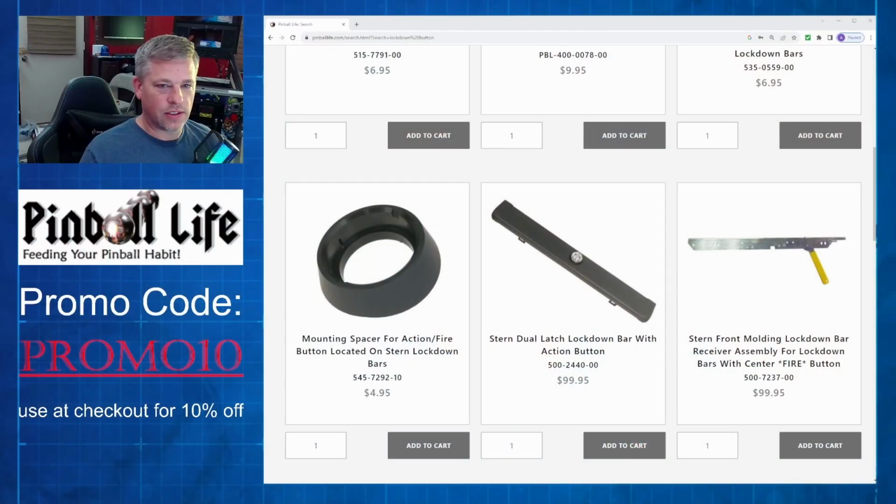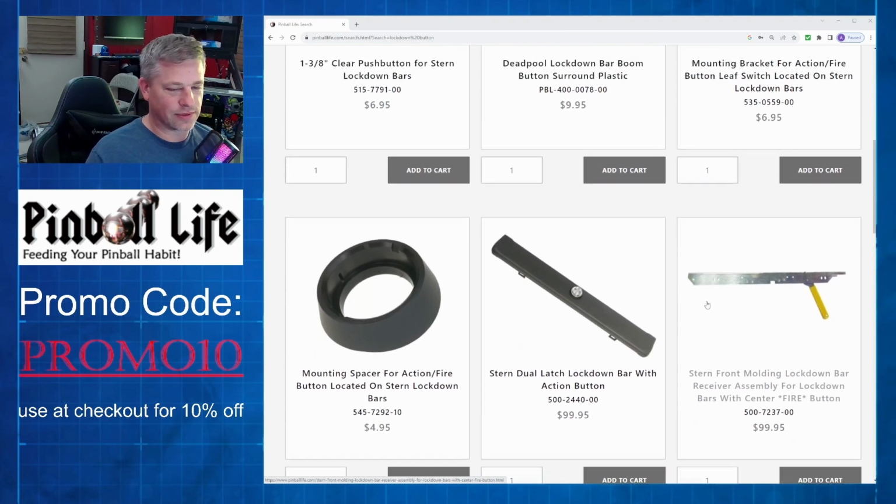So I needed to mention that if you plan on getting a lockdown bar like what I have here, and you want it to have a fire button, when you go to Pinball Life to buy the lockdown bar locking mechanism, you really need to make sure that you get one that supports a fire button. That's because it makes everything closer to the edge, and there's a nice little hole in the top so that your button can push through it. I made a mistake. I bought a regular receiver, and so now I've got to jury rig a solution.